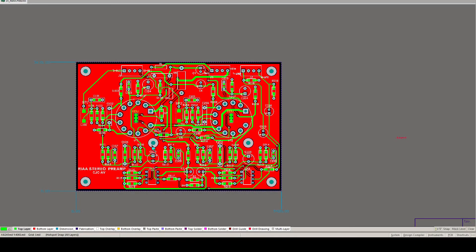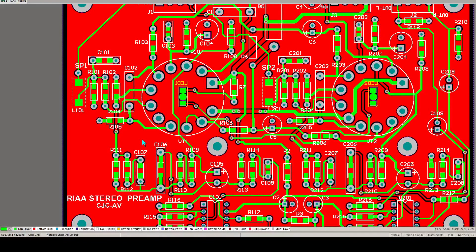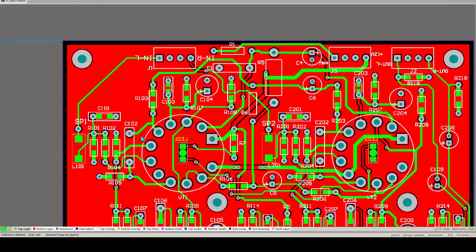I came up with a printed circuit board layout for the RIAA stereo preamp using the 6U10. Green is the top layer, red is the bottom layer. I designed a combination leaded and surface-mount footprint for the resistors — a 1206 SMD footprint embedded underneath the standard quarter-watt 1% leaded part — because some low-noise leaded resistors are getting harder to find. The same approach applies to capacitors. For this design, I'm hoping to use all leaded parts to keep it more traditional for a vacuum tube preamplifier.